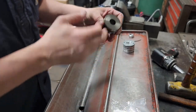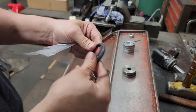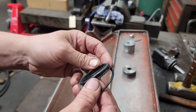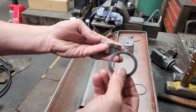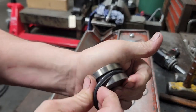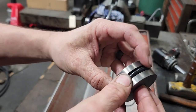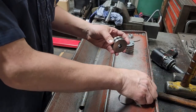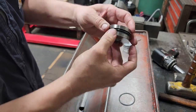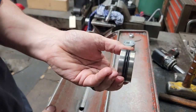I've got my TP seal — this is a 326, same as the old one. There's the o-ring and the extrusion rings. We're going to take the seal first, get it started kind of like an o-ring, get that put in, make sure those little sides are flat and seated. Then take one extrusion ring, put it on, then put your other ring on. That's it as far as that goes — piston is done.